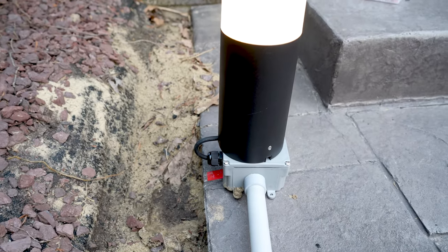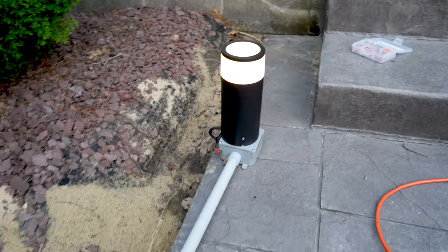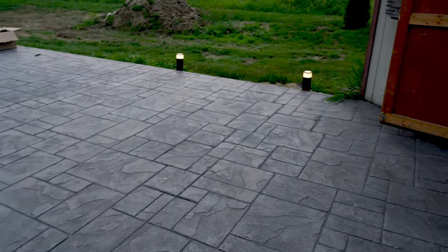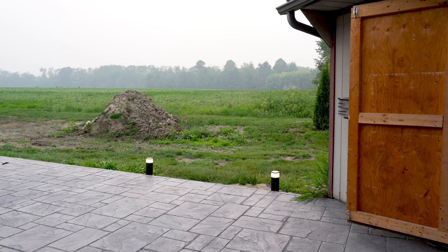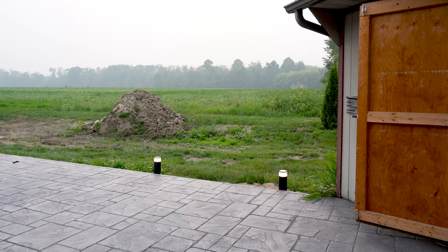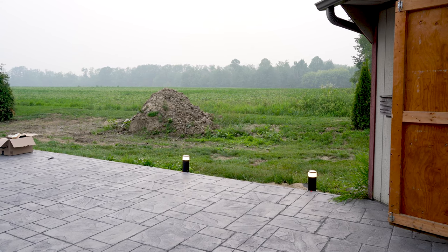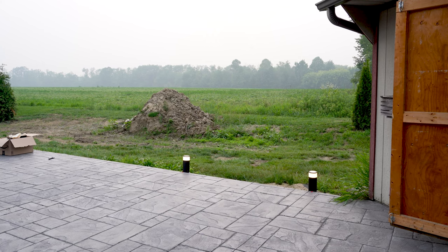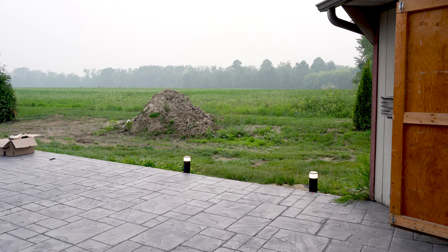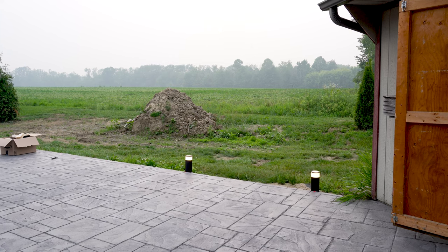Here's what they look like when they're installed — they're just sitting on that junction box, and we've got our little cable gland on the back. It's pretty nice. Some of the problems I've been having is I'm definitely dealing with different revisions of the lights. Some of them have a brown and blue European wire — two-wire on the inside of the exterior jacket — giving me hot and neutral. But two of them are black and red instead of black and white. I learned the hard way that black is neutral and red is hot. I think I fried two lights. So if you're watching this, just know that if you have those different colors, your red is your hot and not your black.